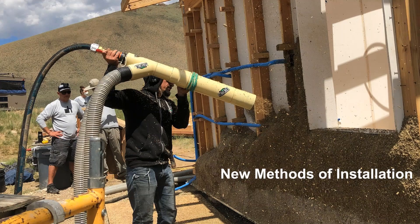Outside of cast-in-place, there are other methods of installing hempcrete. This past summer, we partnered with a French inventor who created a spray-applied projection system that allows spray application of hempcrete into a wall cavity. To put this in perspective: the cast-in-place method yields about 10 to 15 cubic feet of material installed per hour, whereas with the spray-applied method you're looking at about 50 to 60 cubic feet per hour. By no means is it perfect — it's faster but potentially messier — yet it's a leap forward from hempcrete being reserved for that 1% who are both sustainably motivated and financially able.